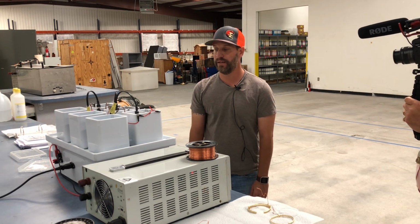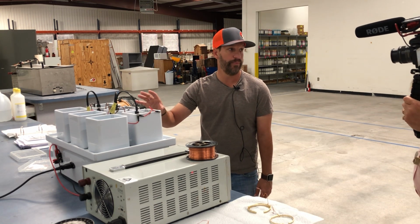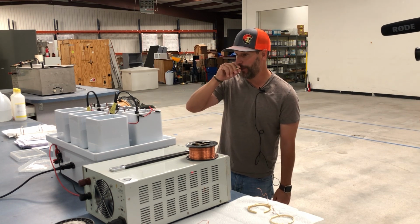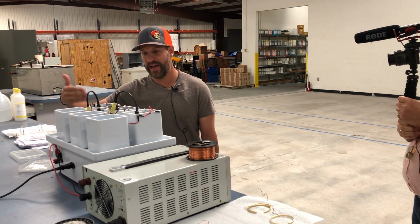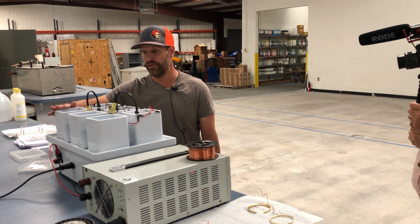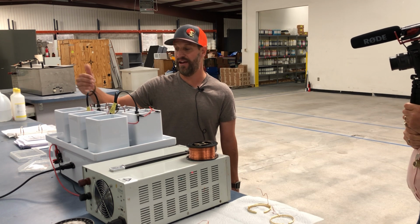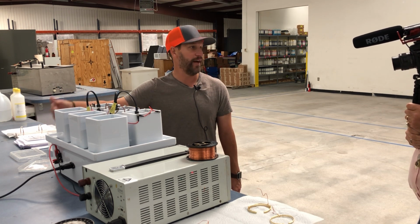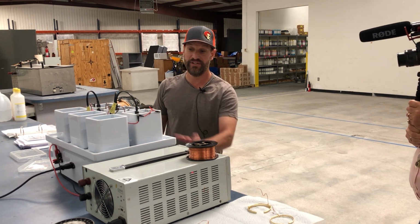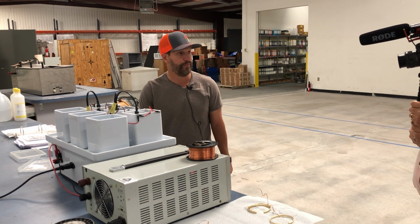Keep your rinse solutions fresh. Really important. So after plating maybe half a day, change these out with fresh rinse waters. Use it if you want to replenish, but if you're not going to do that, keep changing it out. Especially your degreasing rinse and your neutralizer rinse. Keep them fresh, keep them clean.